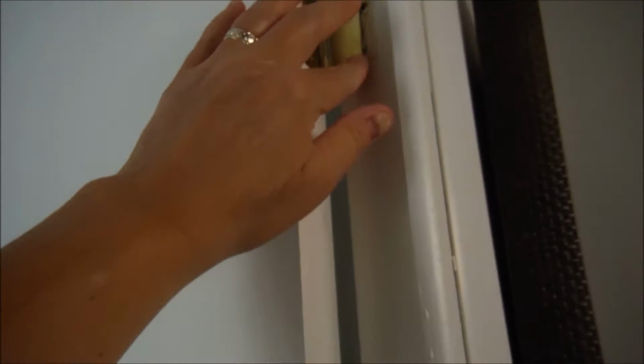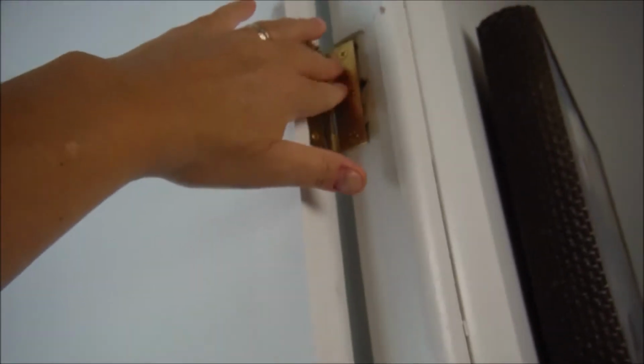The door does close now, and it latches. Got to push it a little bit. And it's pretty level as I could get it around the door. Closes perfect, so I'm pretty stoked about that. I just chiseled out the door enough to have the hinges. So that's an idea for anybody that's doing a door that doesn't want to chisel out the door jambs. You can just do the door just enough to have it close real nice and smooth. So, successful on that. I'm going to do the handles so those look nicer.